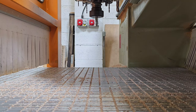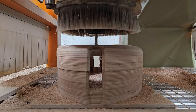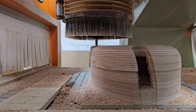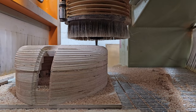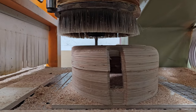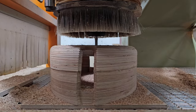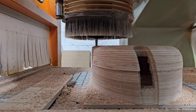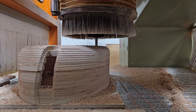So over to a 12mm compression cutter, an EMST cutter. I'm going to wrap it back over after the dust hood drops back down. And we're going to start cutting in the rebate for the driver. So I can never remember conventional or climb milling. We're cutting kind of clockwise for the inside geometry and counterclockwise for the outside. So what that means is it can stay at depth here.